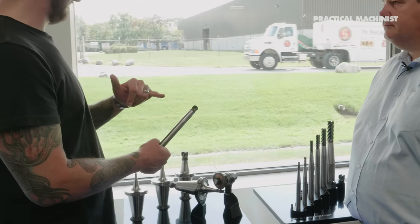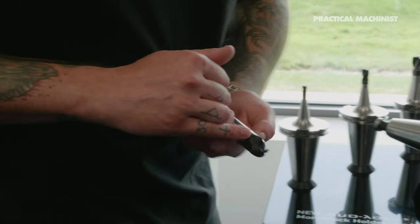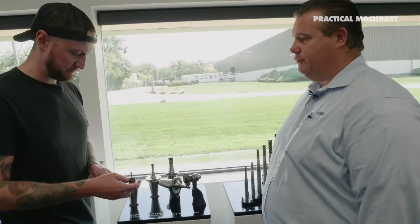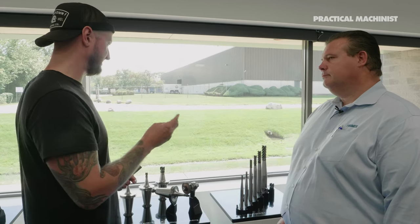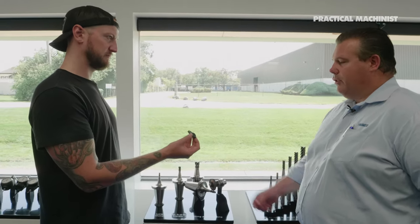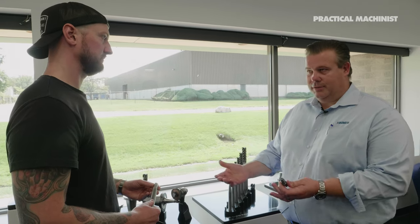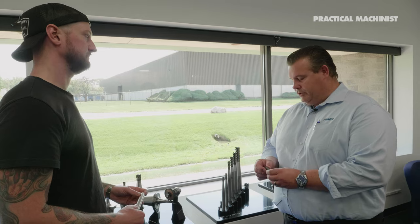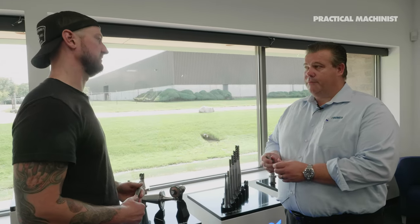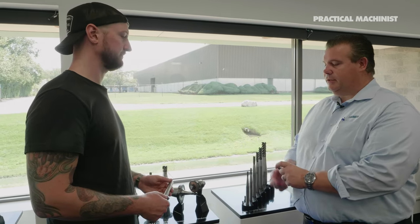You could chuck this up and use that as your cutting edge with a lot less chatter than using a solid carbide tool — you can actually shrink it into a shrink holder. These flats are for a torque wrench so you can torque it down to the proper setting to maximize rigidity. If the cost for a solid carbide end mill of this size is X, this would be X minus 50%. The concept behind Dual Lock is that tungsten started to become more restricted, and if it continued, the cost of solid carbide round tools was going to skyrocket, which would probably force the industry into solid carbide indexables — this uses a lot less carbide.